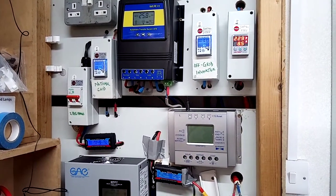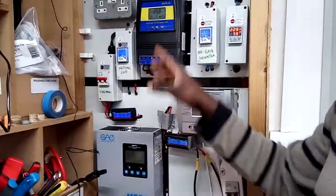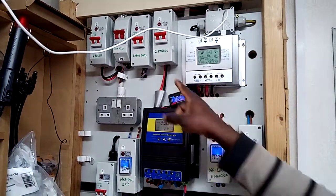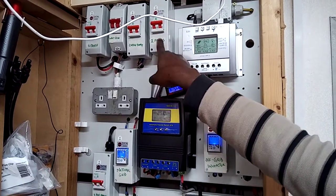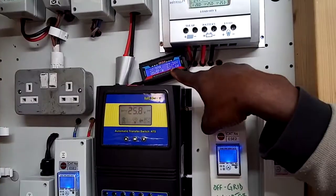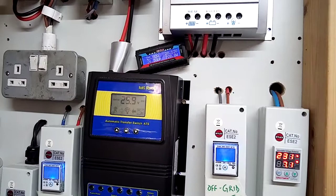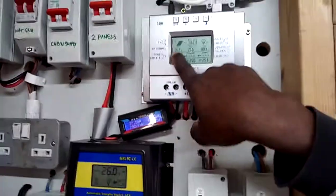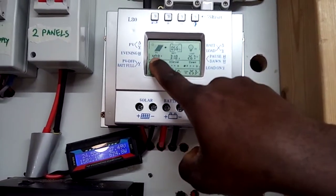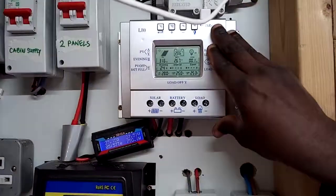I want to put this to a test. As you may know from following this series, I've got three arrays of solar panels. This first one I've upgraded to 1.2 kilowatts — it now has three panels. As you can see I'm pulling up to 24 amps right now, doing about 700 watts. The solar panel voltage is around 40.8 volts and the output is 31.6 volts going into the charge controller and directly into my battery bank.